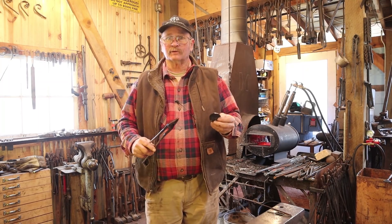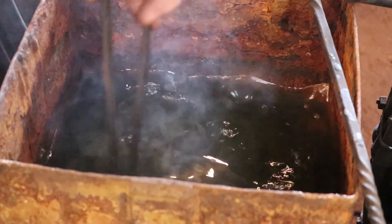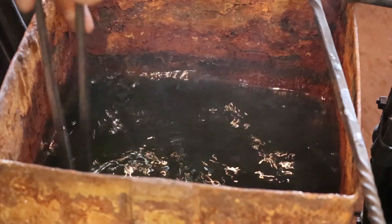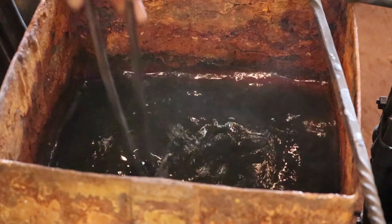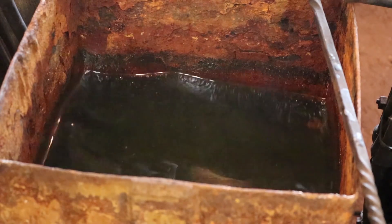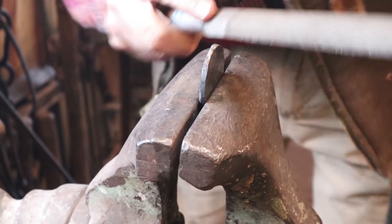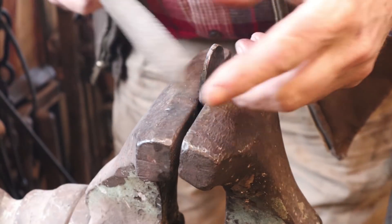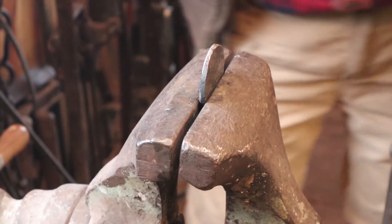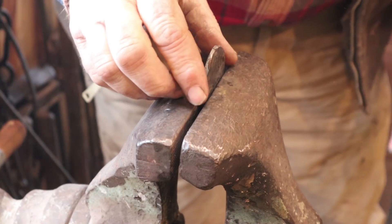As I bring this up to heat for our third and final test, I'm going to flatten it again to get a better idea of whether or not it's bending at all when I try to bend it. So I'll take it to the treadle hammer after a little bit of heat, flatten it, then we'll look at quenching it in water and see what happens. And into the water. This is probably a little hot — somewhere in the low 1500 range for most water hardening steels is better. Now that is much more difficult to file, so that is hardened. It is not glass hard or brittle hard though. And that doesn't bend at all.